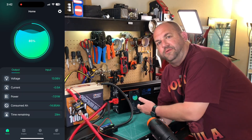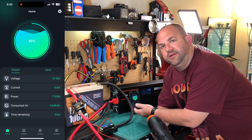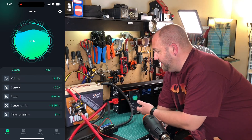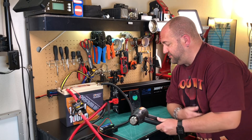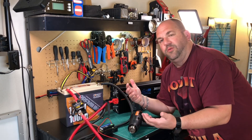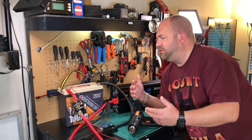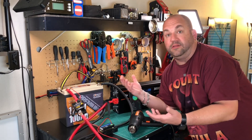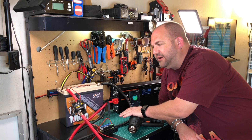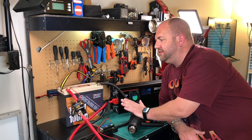So that's interesting. I let this run for about two and a half to three minutes — if you look at the time on my cell phone in the left-hand corner of the video, I started this at about 3:39 and it's now 3:42. So three minutes of pulling almost double what the BMS is rated for, and it doesn't appear there's any overcurrent protection — which I guess is a good thing for a reviewer because sometimes people worry they sent you a pre-checked unit. Well, clearly they did not. So a little disappointing. Other than it just doesn't do what it's advertised in terms of overcurrent protection.